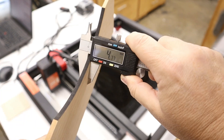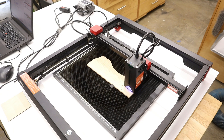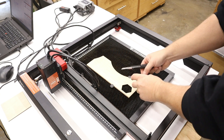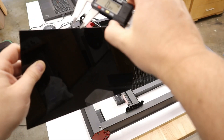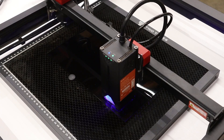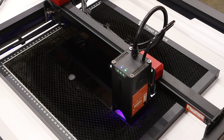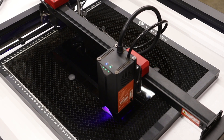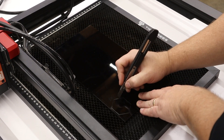Last up for the wood-related cut testing is some quarter-inch white oak veneered MDF. MDF is a really challenging product to cut through, so for this test I was able to consistently get through it at 3.5mm per second at 100% power. Last for the cut testing is some 2.5mm black acrylic. As you may or may not know, diode lasers normally cannot cut clear or translucent acrylics, but opaque acrylics such as the black version will cut. I'm cutting this material at 5mm per second at 100% power. I should also note that during all of my cutting tests I was running the air assist at full power. Overall I'm very impressed with the cutting capabilities of the Alpha.